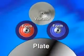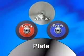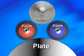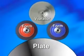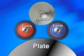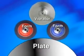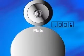Consistent transfer pressure is important to maintain the proper water and ink balance. A non-concentric roller will build up heat due to deflection, making it difficult to maintain consistent water and ink balance. Simply stated, this means you can never set the roller properly. As the non-concentric roller rotates on press, it actually loses contact with the plate or other rollers, resulting in poor water and ink balance. When you consider that it only requires approximately 7/1000ths of an inch movement to create a correct stripe,